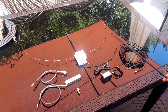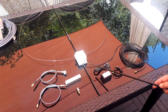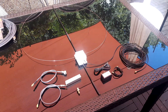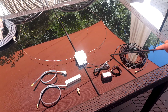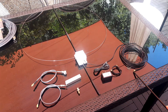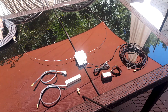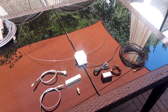Let me talk about what you get in this package. You get the 64 centimeter radiator, which is a wire loop that rolls right up to a smaller size, so you can throw the whole thing in a backpack for portable use. You get the amplifier, and on that amplifier the connectors for the stainless steel loop are also stainless steel, so you don't have to worry about rust. You also get a micro USB cable, a jumper, the bias T-box, and 10 meters of coax cable. It uses SMA connectors — my first impression out of the box was that the designer had SDR radio in mind. But with a small adapter, you can use your standard shortwave radios. I went a step further and bought a connector for my portable radio and a longer jumper for my desktop receiver.